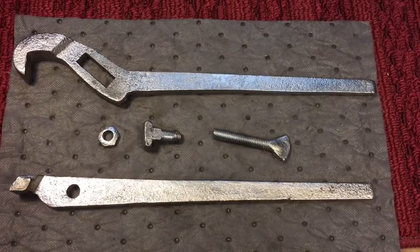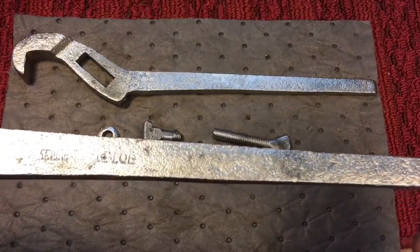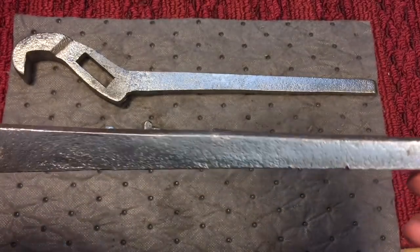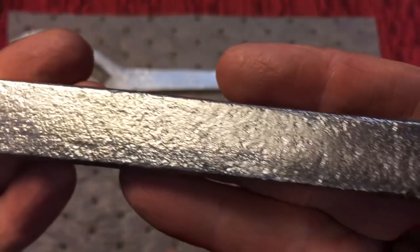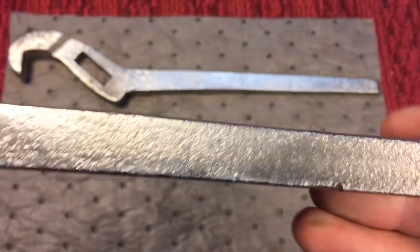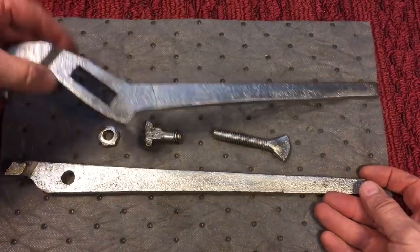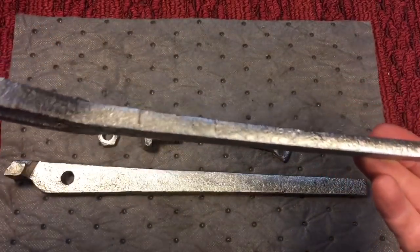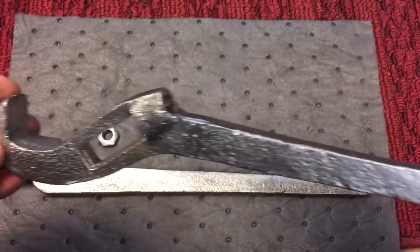Okay, here we are at our post wire brush evaluation, and some of these things when I film them, they look really shiny, and they say, well, you can just leave them like that. But if you look really close, you can see the pitting and the forge marks and things like that. So sometimes you see why you have to opt for paint. Now, obviously, we're not going to take this down to a polish or on the belt sander or anything, because that just wasn't the way these tools were made. What we will do now is go over and put a coat of shellac on it.